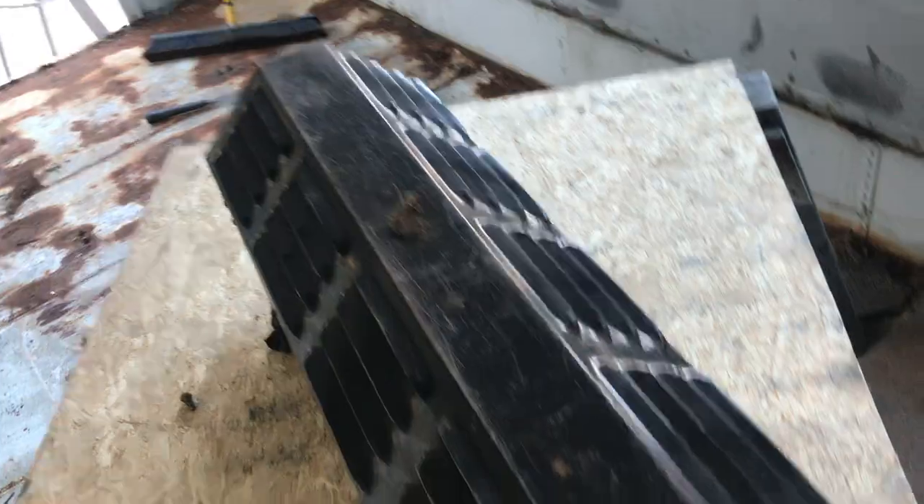Today's project is getting rid of the heaters in the back of the bus. There are a couple of them here. Those hoses come across the floor, go under the door, across here and into the dashboard. The ways we could approach this - sometimes you could do a loop around it inside the engine compartment.